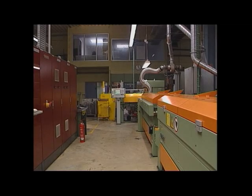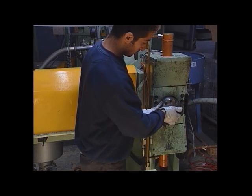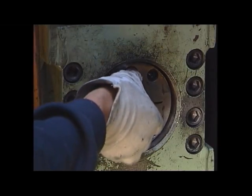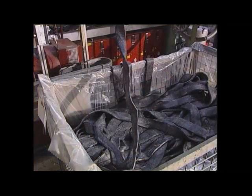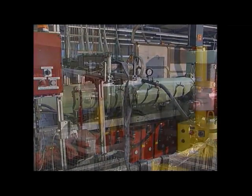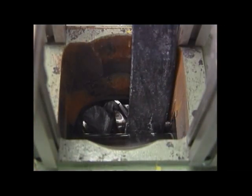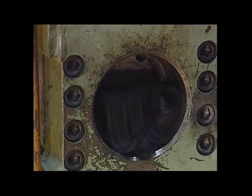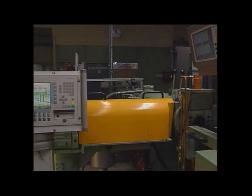How is a flocked profile processed? At the beginning of the line there is the molding machine — the extruder. It compresses rubber through a shaped nozzle. Such nozzles determine the profile geometry. In addition, complex profiles contain metal inserts or areas made of different rubber compounds. The raw rubber is fed into the extruder. The type of rubber compound used is decisive in determining the rigidness of the profile and all other required characteristics. Screw systems plastify and convey the rubber compound through to the nozzle, which forms the profile. The central control unit ensures the controlling of the entire line.